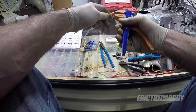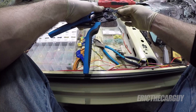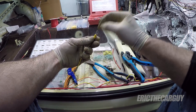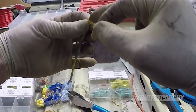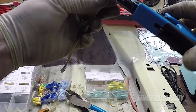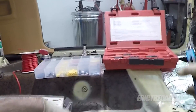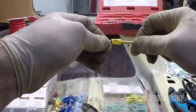Taking off a quarter inch of insulation here. We've switched back to insulated, so we've got to change out our die again. With these insulated connectors, maybe a little bit of conductor is sticking out just so you know the conductor is seated down inside. When I put this in the tool, these are split at the top — so I'll push down on the split side and take the other side and put it down into that cradle. See how it's cradled in there? And when the tool comes down on it, avoid over crimping. I was right on the ragged edge of it, but I certainly made it. And there we go — a nice tight connection.